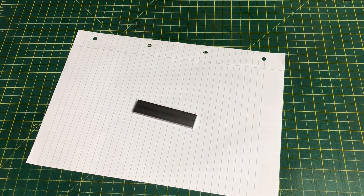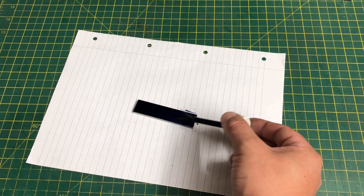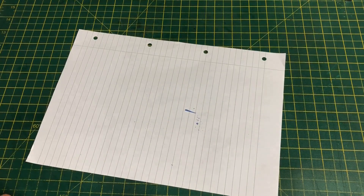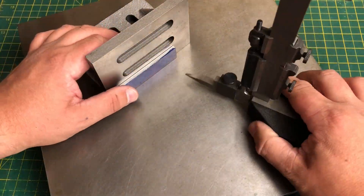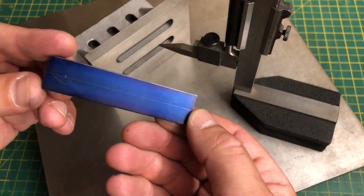We are back at the bench for some layout. Again this is not necessary as I will be dialling in all of the hole locations using the DRO on the mill, but I have been known to misconvert fractions to decimal in my head, and with the layout I can often see the mistake before the centre drill touches the work. A quick centre line followed by three hole locations completes the layout, and we can move it back to the mill.